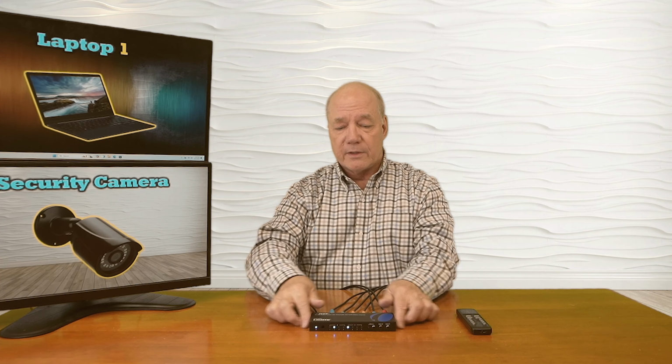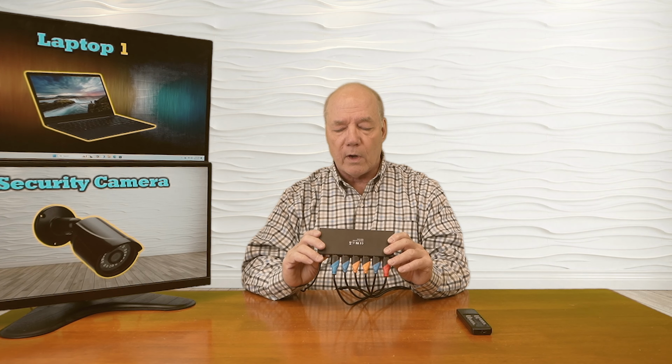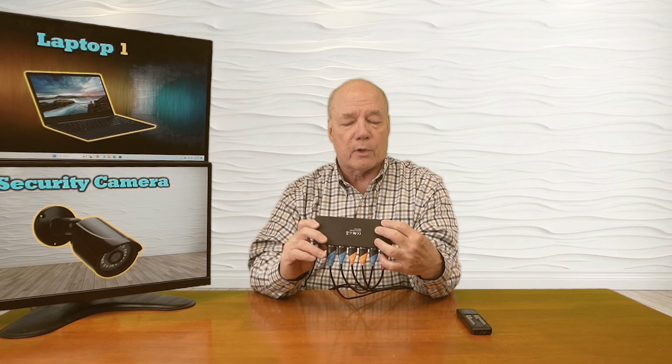And there you go. So right now on A, you're looking at input 1, and on B, you're looking at input 2. And to change those, all I have to do is tap these buttons or use the infrared remote control. So let me change to the next input on A. It'll take a second for it to make the adjustments for the resolution. Then you'll see the displays come up. And the nice thing about a matrix is that you can see here, I've got the same input going to both monitors, or it can have any input go to either monitor at the same time.